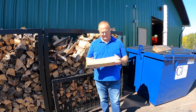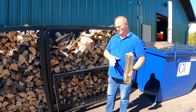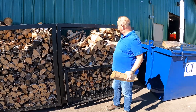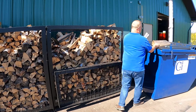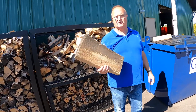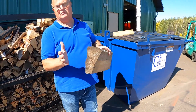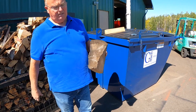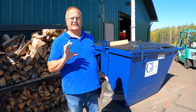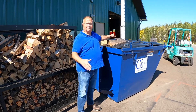The VaporFire generally likes 20 to 21 inch long chunks of wood, preferably not split any smaller than that. We do like nice big chunks — they burn longer and nicer. We like chunks that are 6 to 8 inches across. If you have a 6 inch round, leave it alone. If you have an 8 inch round, give it a single split.